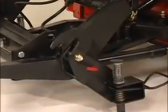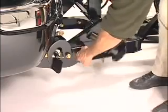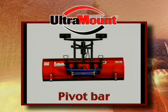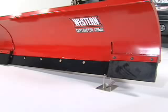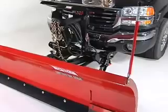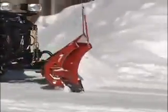And most importantly, no electrical components to fail. Detaching is just as easy: unplug the electrical connections, pull the lock pin, rotate the handle down, and push the shoe down. Repeat on the other side and you're done. Much like large municipal plows, the Ultra-Mount incorporates a rotating pivot bar that offers two significant real-life benefits. The pivot bar allows the attaching points to remain level even if the plow blade is not, so you always get accurate drive-in alignment, saving you time and frustration. The pivot bar also allows the blade to pivot during plowing to hug uneven ground for a cleaner scrape and more even cutting edge wear.